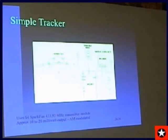Now, I used an Arduino in this case, and all I'm doing is keying on and off the data line. You can set it up to just do straight Morse code, or one technique, they do drift. They drift 10 to 20 kilohertz during a mission. But if you pulse width modulate the input with an audio tone, and you feed it a square wave, you get beautiful AM modulation. So I can send teletype, Domino EX, any multi-frequency shift key mode I can send this way and receive it on AM mode, it solves the drift problem. You don't even notice the drift when you're listening to it on AM. And you can use all those wonderful different modes.